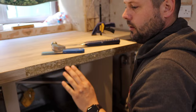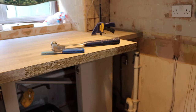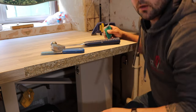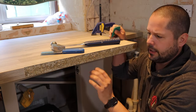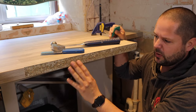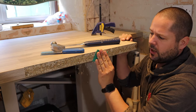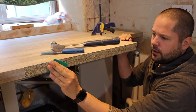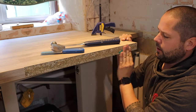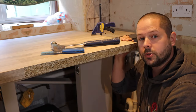We've not damaged anything. We've got a nice clean crisp edge where it's going to meet up with the other piece of worktop. Now at this stage you can feel it's all a bit fluffy and gnarly and there's some glue left on it. So I just take a piece of sandpaper and give it a real light rub down — that gets rid of all the nasty bits and gives it somewhere good for the glue to adhere to.